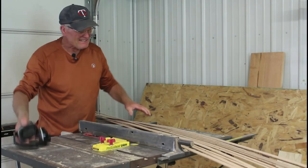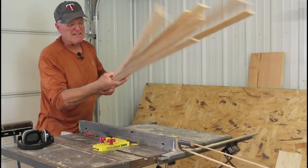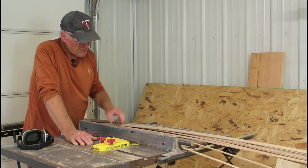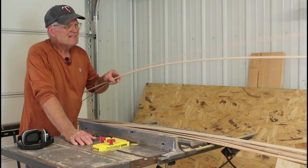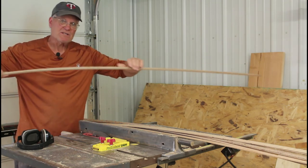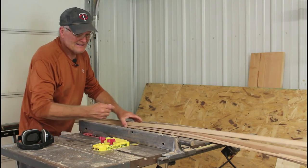Out of those two seven-inch pieces of Okume that I scarf joined, I ended up with 12 one-inch by eight-foot strips. I'll join those together and end up with six 16-foot strips. There's inevitable waste — you subtract the width of the saw kerf with every cut. These little leftover strips would probably be handy for something; I could scarf join them together and have a nice batten, which I need a full-length batten for sweeping the arc when cutting the side panels.